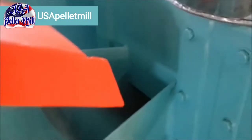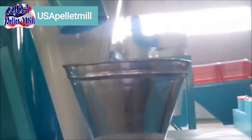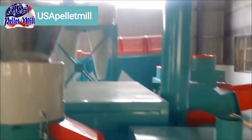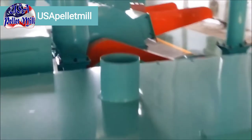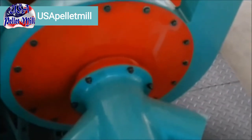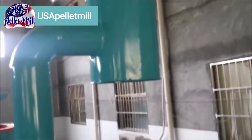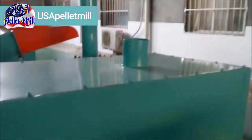The pellet mill is going to dump these pellets into the cooler. The pellets come out too hot to be bagged or used and need to be cooled down. If it's not done manually, you put them into this cooling system. You can see these hose connections on the top — this is another fan. The cooling system actually sucks out all the dust and puts it into a dust collector, which hangs from this little mount and collects the dust to be repurposed.